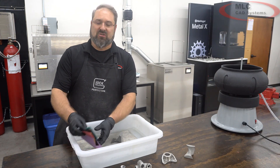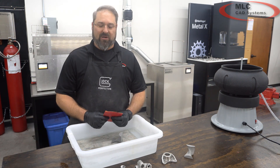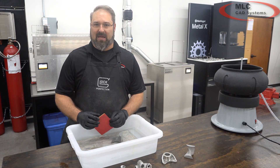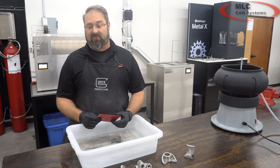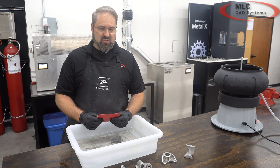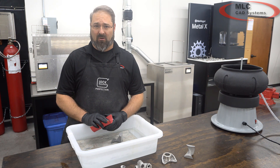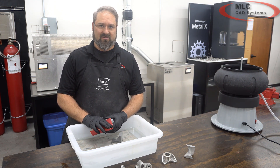Let's start at 220. Now, 220 is pretty rough — you want to be really careful with it. It will take off a lot of material in a hurry, and in other words, it's really easy to ruin your part. What I like to do at 220 is just do a light sand — I don't want to get aggressive. I'm trying to just knock any heavy layer lines down or any heavy ridges, and then I'm pretty quickly going to step to a 400.